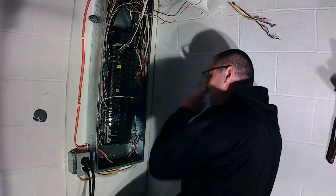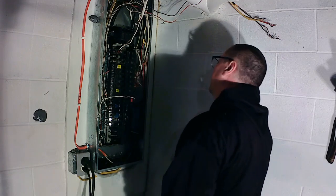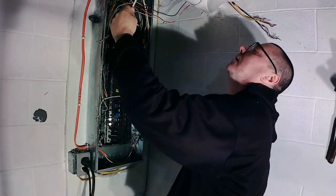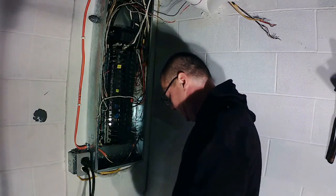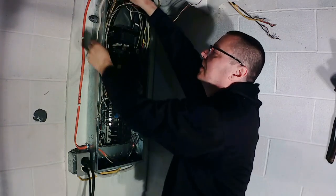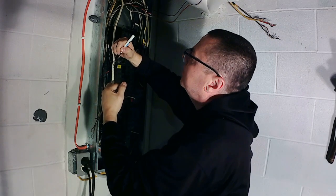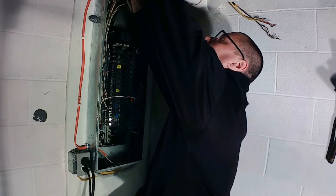That button's good. That's still on. Okay. So it's just the north. So it's the north outlets. Okay, so there's three outlets in the bedroom. All right, we're good. All right, guys. So it's all the bathroom and three outlets in my bedroom are on that one circuit. And that's what master bath and north outlets. I get my handy dandy marking device out here. North outlets in MBR. There you go. We got that figured out.